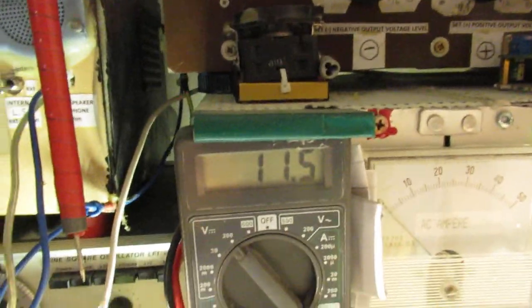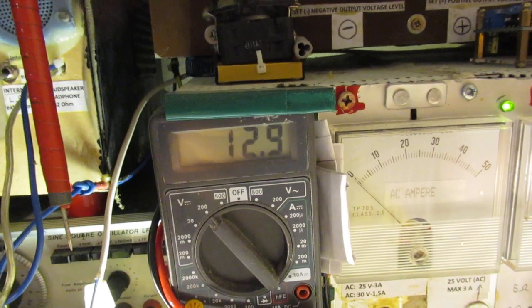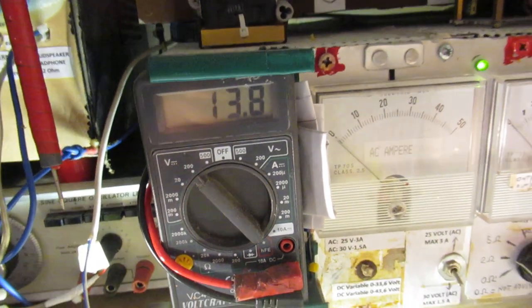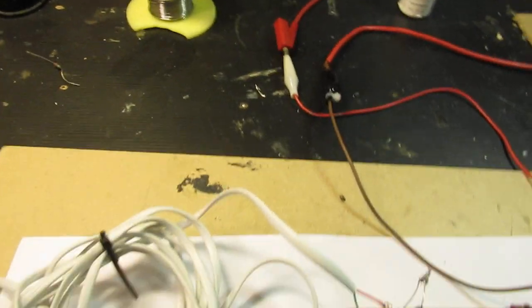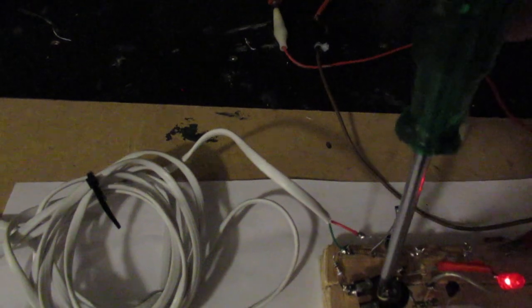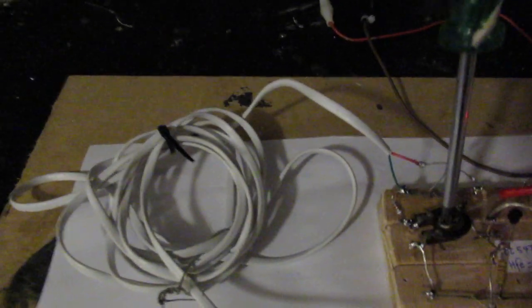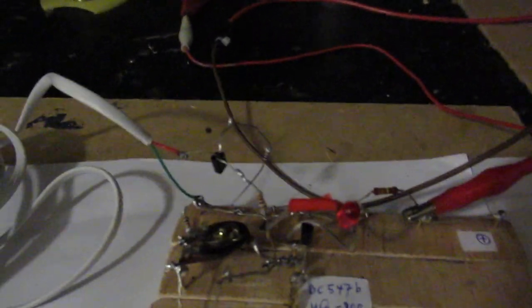So that was more or less all to tell. Here we have 11.5 volts. Let's go to 12 volts. When a lead acid battery is charged, we are on approximately 14 volts. So this is the situation. And you must, of course, align the voltage where it wants to work. So now we are on approximately 14 volts and are with the sensor on room temperature. So with the potentiometer, you can switch out that LED so that it doesn't light up any longer.